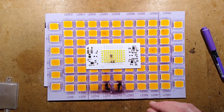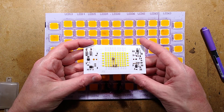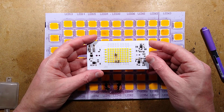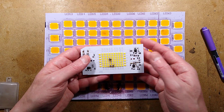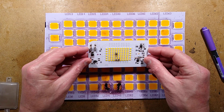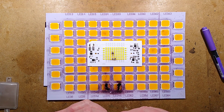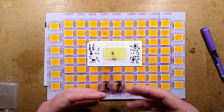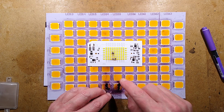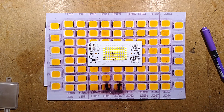That is really the way things are going. I've come across so many of these that have leaked onto the case, with people reporting shocks from fittings when they touch them — because it is leaking onto the aluminium, and either the earth isn't connected or there's that missing wire, providing an alternative current path through the person. Perhaps the IET in the UK — our electrical regulatory body — should look at enforcing the transition to type B RCD and GFCI circuit breakers to detect the increasing number of these progressive fault scenarios.